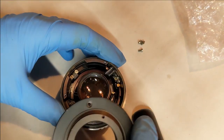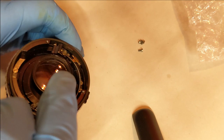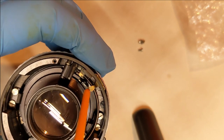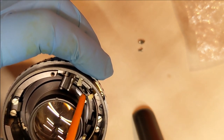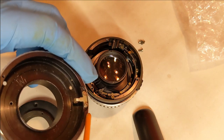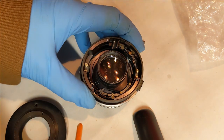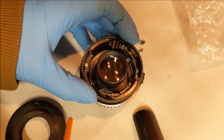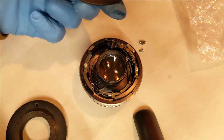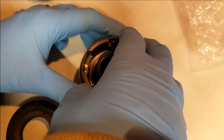There are no extra parts on the back of the metal case. The problem looks to be over here — something described online as being replaced the wrong way around. That part looks like it should connect to the lever that goes down into the lens. Looking at my other Pancolar, this lever does look slightly different — it's bent in a different direction. It doesn't look upside down; something inside the lens has actually bent that part, possibly a broken stop or screw.